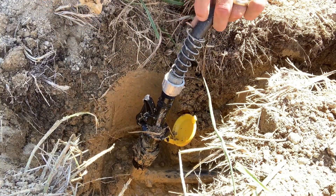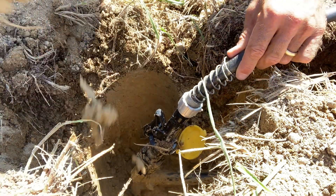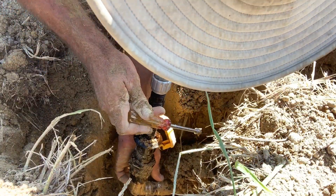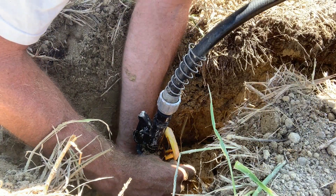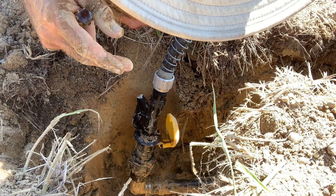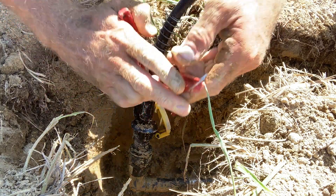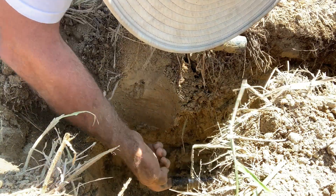I'm going to pull it up and get it on a rock or a piece of wood so I can prop it up out of the mud. While I've got my hand muddy, I'll scoop out more so I'm not working in it. I think I see it here — let me loosen this one up a little bit more. We've got a big divot in the pipe. Maybe I went too close to the edge with that second clamp. I'm going to cut that section out, clean it off, replace the hose clamps with ones I know are the right size, and then test it again.